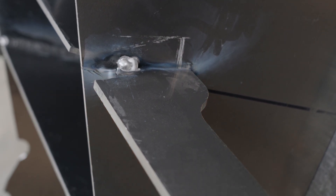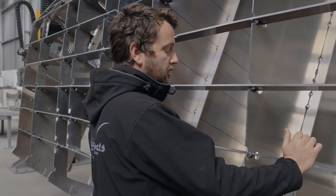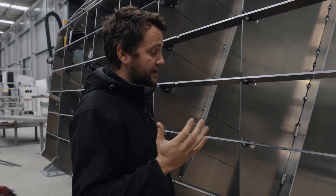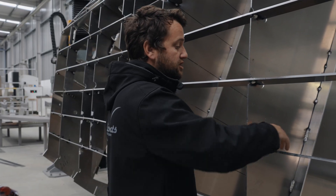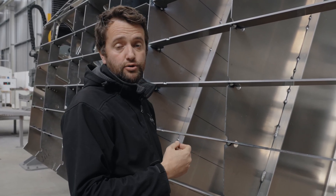Another really important feature of a Lloyd's hull is that stringers should always have a limber above them. This round hole here is really important because it prevents impacts on the stringers cracking the frames. Obviously a lot of impacts are happening on these stringers when they're supporting the hull plate, and if you don't have that rounded hole it has the potential to cause cracks to spread through your frames. It's actually a Lloyd's special service craft requirement, so if you see a boat that has stringers and they don't have a round hole above the frame where it intersects a stringer, you know that is a potential cracking area.